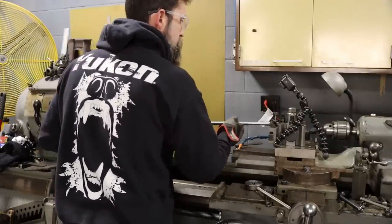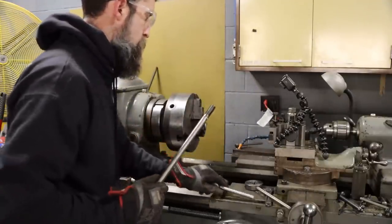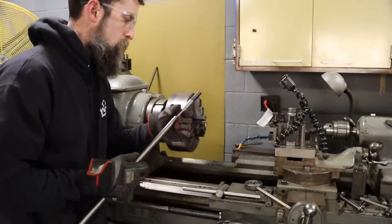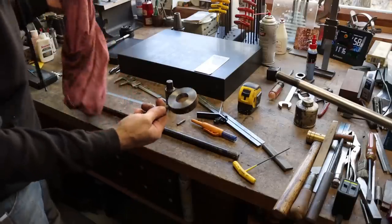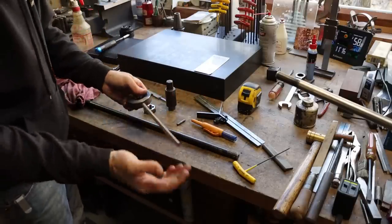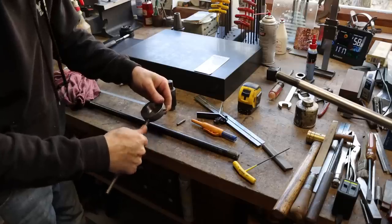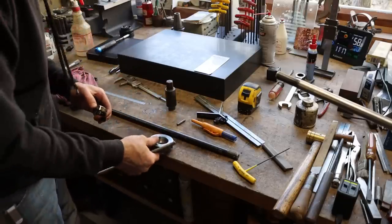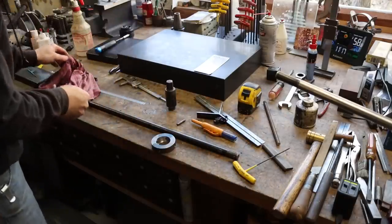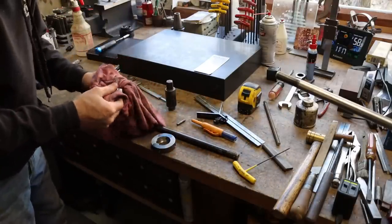I have got to make the change gear for this thing so I can cut metric threads on it. Looks good though. So this makeshift die holder actually worked pretty well. That threaded rod's hard on the hands. I'll have to make some decent handles for it and some thumb screws to lock the die in. So, better than a pair of channel locks on a die.